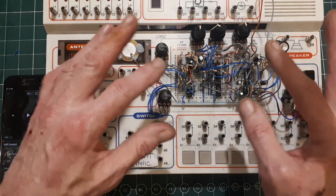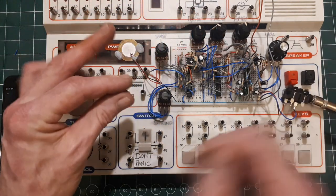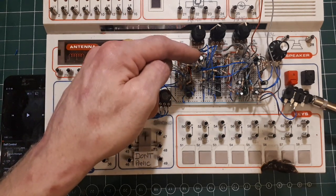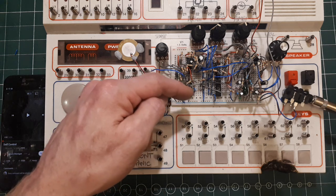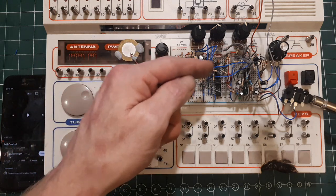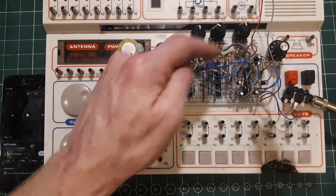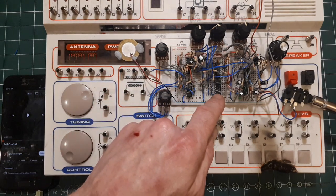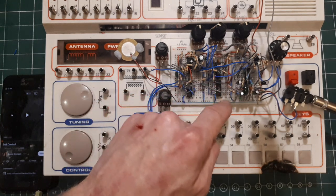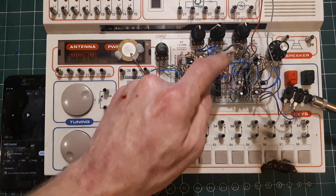Despite it being on a proto board and its little glitches as a result, it works quite well. We've got the trigger set up here along with the white noise generator here. There's a set of logic gates here to give you the required pulses — you get a main hit through, then another three or four coming off this. This is a VCA done with an LM13700, one on either side, and this is a 7-bit counter. These logic gates fire the clock here, and we're taking off our signal from here to control the voltage control amplifiers.